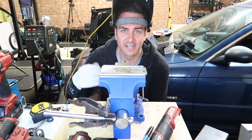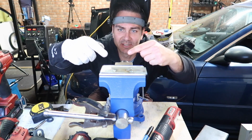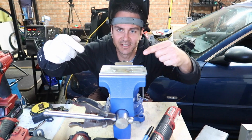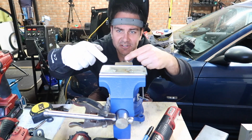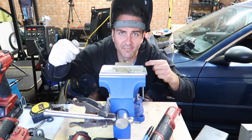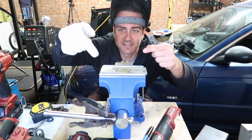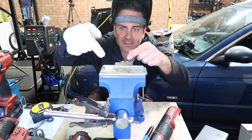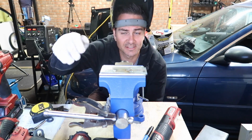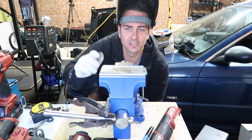Alrighty, so what I was finding with that was that as I was trying to dip the filler in, I was dipping the torch in as well. So the tungsten and the filler would touch the material together and then the tungsten would get stuck onto the material. So I've just got to practice getting that coordination right, keeping the tungsten at the same height but just dipping the filler in. So obviously it's going to take a bit of practice, like everything, but not too shabby. I'll give you a look at those now.